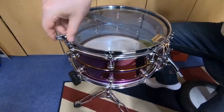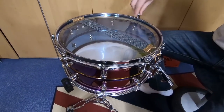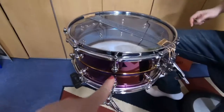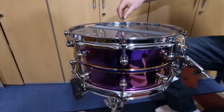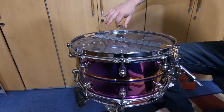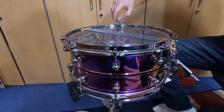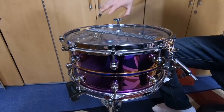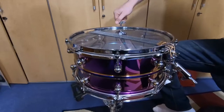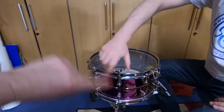So what we're doing now is undoing all the little screws. We start with one screw, and as soon as it goes slightly tight he's going to stop. Then he's going to do one and a half turns off the screw, and you've got to do it in alternating positions — across from where you've just done the previous one.